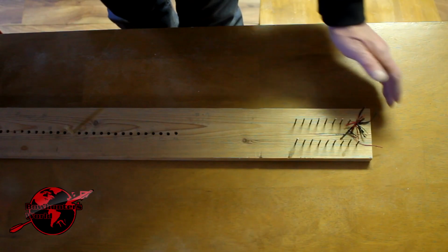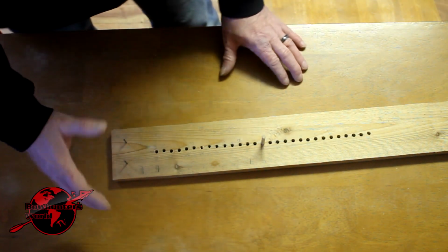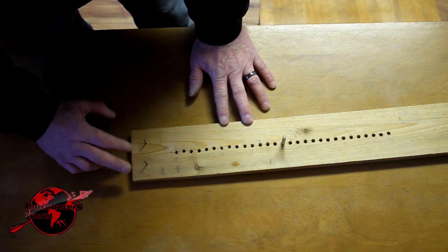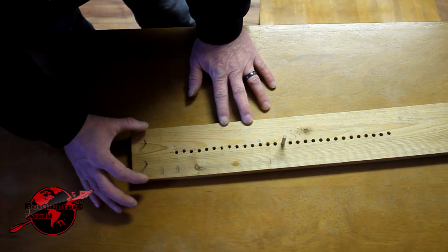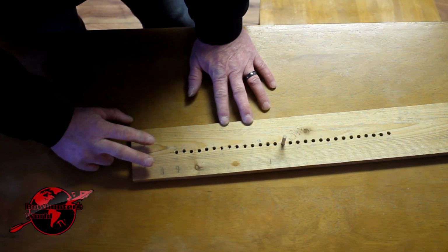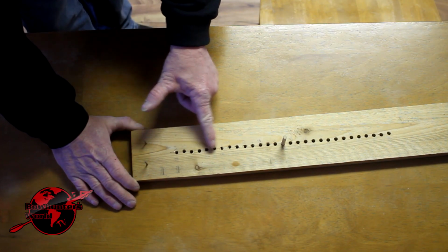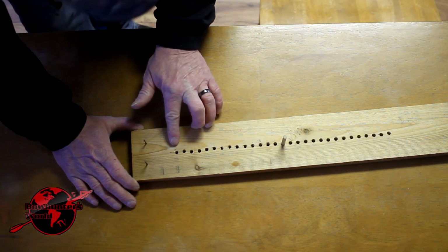And then from the opposite end over here, and I know my lighting's probably really crappy right now, and I apologize. So on the bottom end of this, you're going to go in an inch and then in an inch on each side, and you're going to set 2 more finish nails. Then what I did was I come in 3 inches and then set a hole every 1/2 inch, and I have no idea how many I got in here.